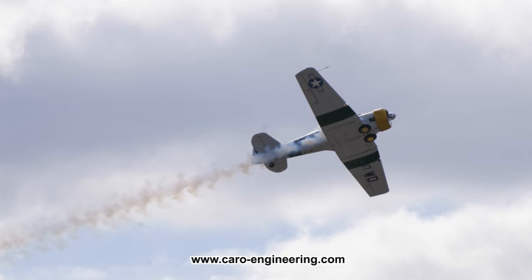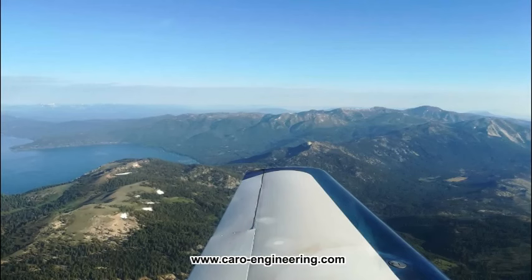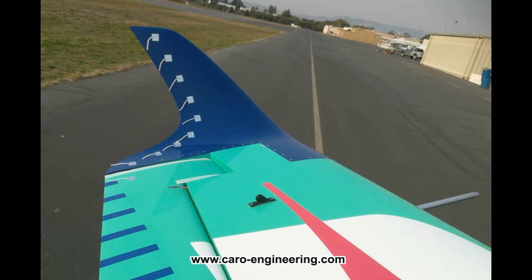This airplane is a good example of how it should be. The T6 is one of those with the nicest feel of the controls that I have flown, even though it is heavy and fast. Air loads increase with speed, and so the load and pressure on the hinges is higher the faster you fly. This means you need more force to move the stick in cruise than in slow flight. Aerodynamic balance horns can reduce the control surface hinge moments, but not the pressure on the hinges.